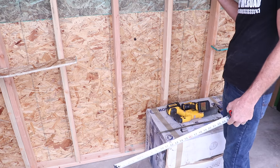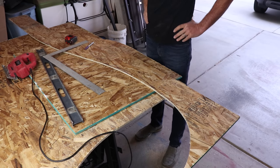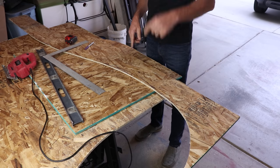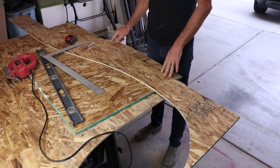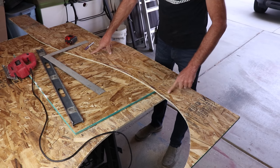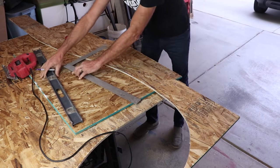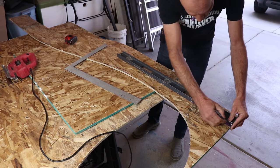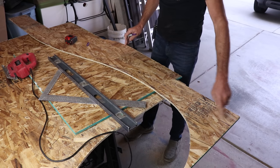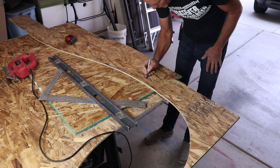I've got this oddball scrap piece here — I'm trying to save money and not cut into a big piece of plywood just to use a little bit. The problem is it's pretty narrow and already has kind of a curve in it. I think over here if I go 4 inches and then transition it over there by eye, I might have something. I got a mark at 4 inches here and 8 and a half there, and since it's already got this curve in it, I say we just extend that curve and transition back onto this piece.